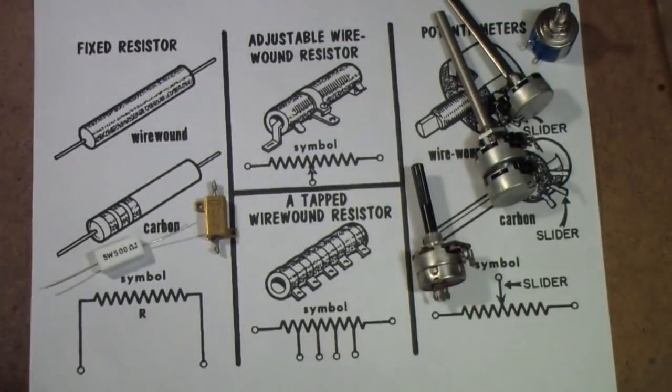By tolerance, what we mean is plus or minus 5%, 10%, 20%, etc. It's not uncommon back in the day for there to be 20% resistors, which means a 100 ohm resistor could read anywhere from 80 to 120 ohms and still be within spec.